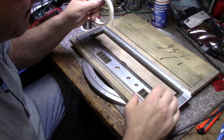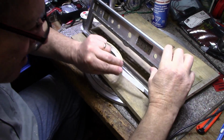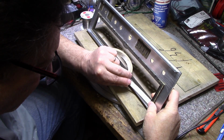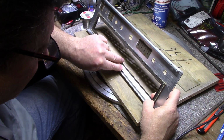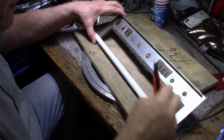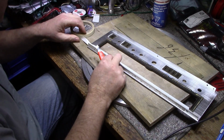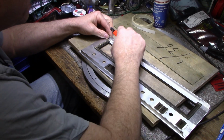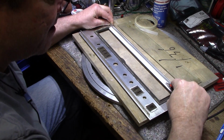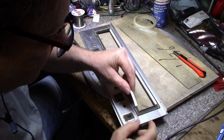All right, so let's try this on camera. Double-sided tape here. What I want to do is line up the tape with the inside edge of the bezel. So let's just put this here, line it up. Okay, sorry for the interruption there. Okay, so I got this set on the inside. You can't see it from the outside, so let's cut this short here. Take this off. Okay. Now I want to get this to the proper width, so I'll just cut on the inside. And this piece can come away. And we'll use it on the sides and the bottom. Just like this.